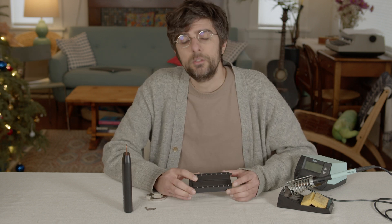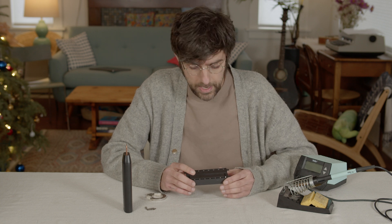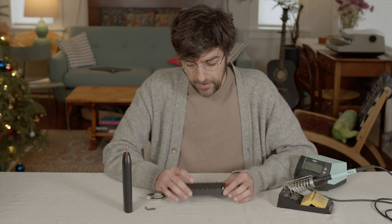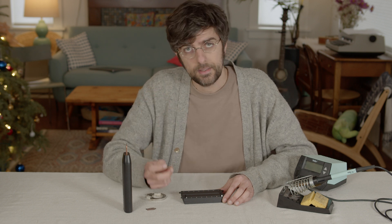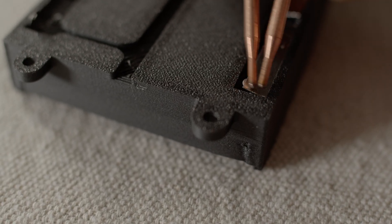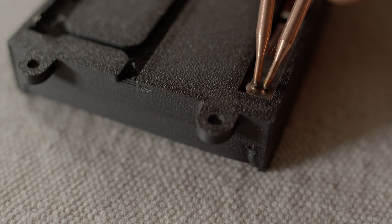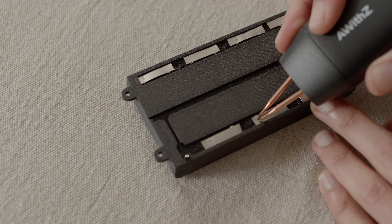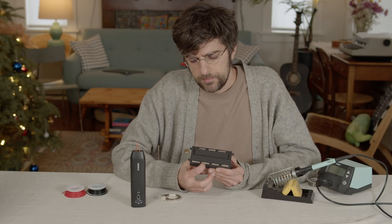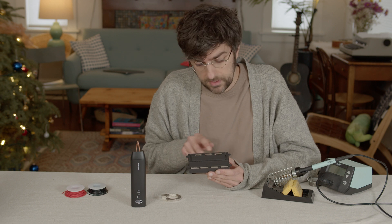There are a couple of options for connecting these. You can very easily solder them using 22-gauge wire. I do a lot of these and make them to sell, so it's much faster for me to use pure nickel strips to connect them, the same way you might connect an actual battery pack. I use a spot welder and do a couple of welds on each one just to make sure they're solidly on. The battery terminals end up being alternately welded together, and if you're doing it with wire it will look the same, just with wire.